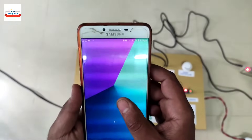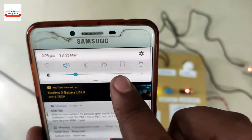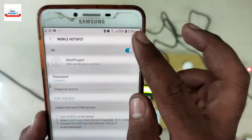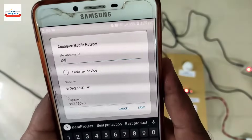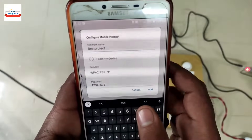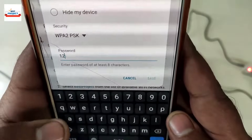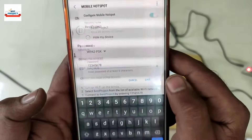To see the data online, we need to connect the setup to WiFi. For this, we will use a mobile hotspot. First, go to hotspot settings, then go to hotspot configuration. Change the WiFi name and password according to the code. After filling in the information, save the settings and turn on the hotspot.